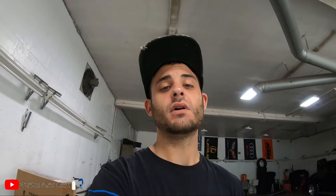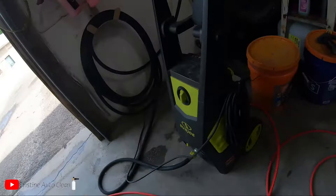The only reason I'm replacing my current unit — a Sun Joe — is it's a piece of crap. It was like 80 bucks on an Amazon flash sale from 160, so I got my money's worth. It's probably prepped 500 cars. I've had GreenWorks machines, Ryobis — they're all junk. For a typical homeowner they're fine, as long as you prime the system and bleed the water out so it doesn't cavitate. But in a professional setting, it's not if it's going to break, it's when — and it's going to break at the most inconvenient time. Time is money.